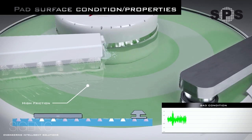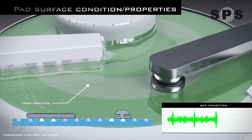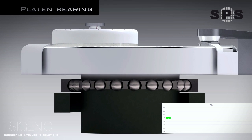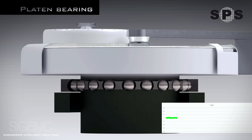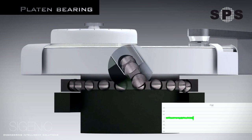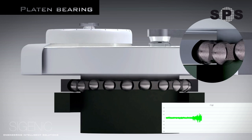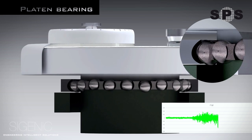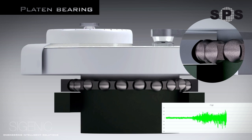Such uneven water distribution can be inferred from the undesirable high Z axis reading. Aside from the direct vibration reading from the PC arm, the sensor will also read unwanted vibration induced indirectly, such as rusty bearings in the polishing platen. The worn out bearings caused unstable torque that resulted in wafer polish endpoint instability.